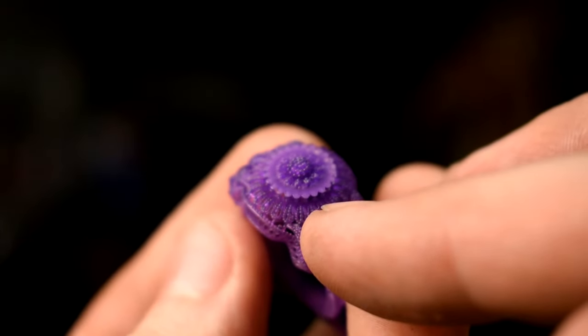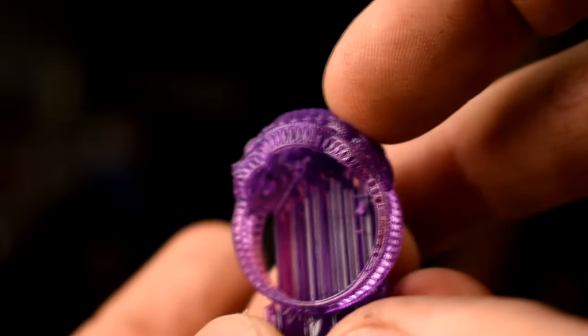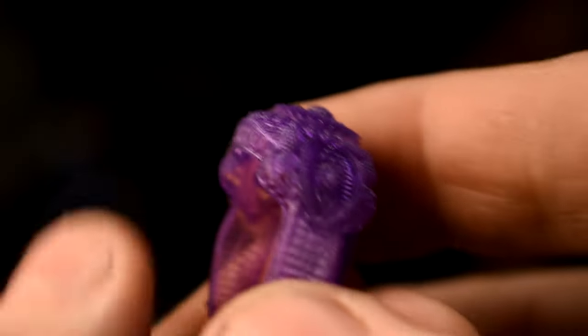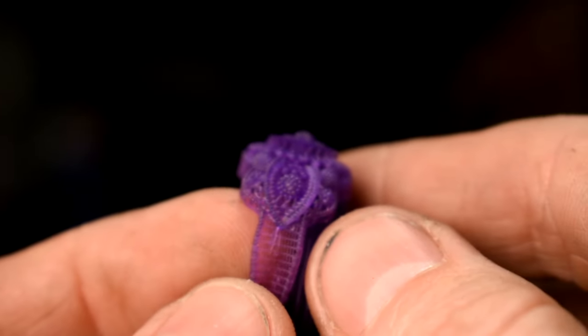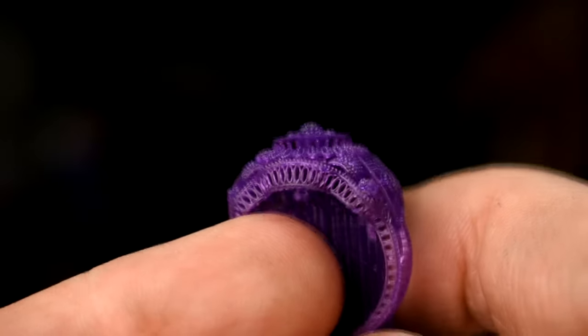It's hard to focus on something this small. This top thing here — that's not supposed to look like a little flower. That actually broke off. There was this fine filigree stuff holding this top up, and I supported this myself. This is not a pre-supported file, and I did not do auto-supports. I thought I'd be smart and try to do it all myself, and I apparently didn't support anything under that ring, and it just broke off. But get a load of some of this detail — it is such fine detail that I can barely get it on video. This is a 10-inch 8K printer, so anybody saying a 29 micron pixel is too big — is it really? And this isn't even easy-to-print stuff; this is a difficult resin to print. I'm kind of bummed, because if I had done that right I definitely would have tried casting it. This is, to date, the only print that came out that I couldn't use with this resin on this printer.